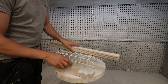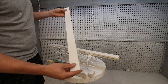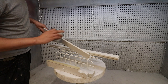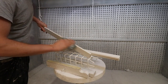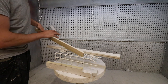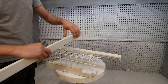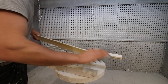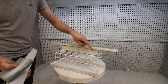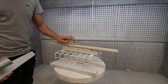The first side of them is dry — one side's not painted, we've just got two edges and the face that's been painted. Before a proper de-nib on the sander, I just de-nib the sides or edges of the piece with the extractor fan on so I've not got any dust I'm breathing in. It takes it from a really rough edge to a very nice smooth finish without a lot of effort, and it's a key for the next coat. Then I paint them this way up — spraying the edge I've just de-nibbed and the side that hasn't got any paint on yet, laid flat so I can put a tiny bit more paint on that edge.